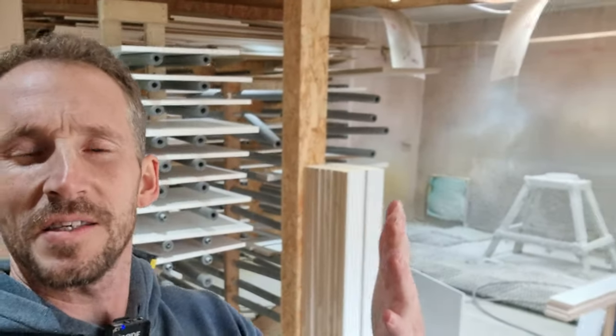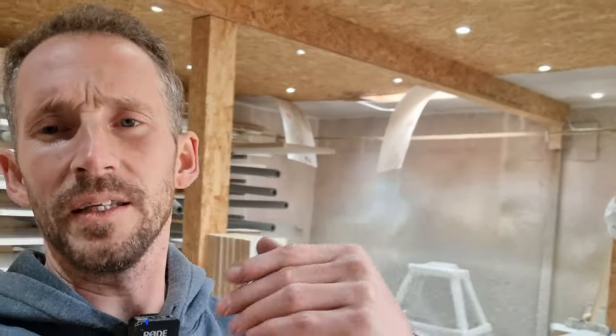So it worked. That is the moral of the story. You don't necessarily have to spend two or three times the amount on materials if you just want to put a little bit more labor into the job, into sanding back, making sure that the fluffiness has been rubbed back, because that's all it is. When you machine into MDF, the cheaper standard material generally fluffs up more than the expensive stuff, and that is the only difference, especially when you spray.